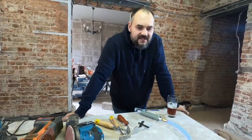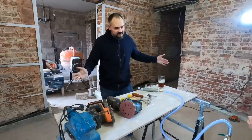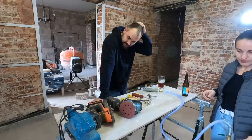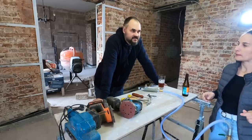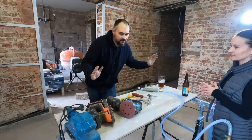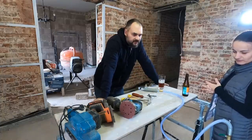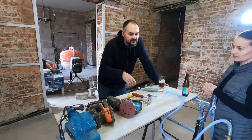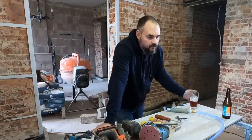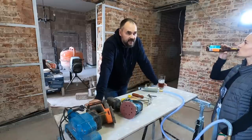It was also my mistake. You need a really big air compressor. I bought one big enough, but not very big, to keep it movable to reuse in other projects. Silent compressors are really expensive if we're talking about big ones, so I compromised and bought a middle one, but it was not enough for soda blasting. You can work for 1-2 minutes, and after that you need to take a break and wait a few minutes. So it's worth buying and trying a soda blasting machine if you have a really big compressor. The best choice is 300 liters per minute.